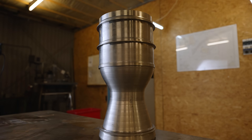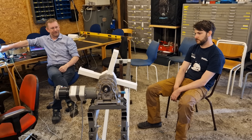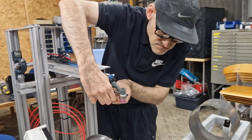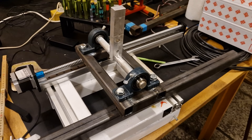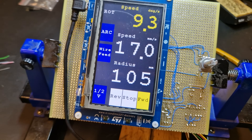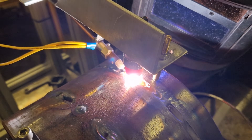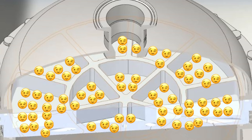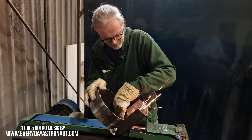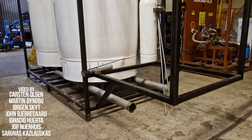We've also made a lot of progress building and testing our DIY automated welder that will help us mass-produce these engines repeatably and reliably. It works by slowly spinning engine parts underneath a welding torch and wire feeder that rest on a linear guide rail for precise positioning. From there it's a delicate balance between rotation speed, wire feed rate, torch position, and power to produce beautiful welds — but that's for another video. For now we'll go back to machining injectors, making the best weld seam chamfers we can, optimizing our welder software and settings, and integrating the test and fluid system.